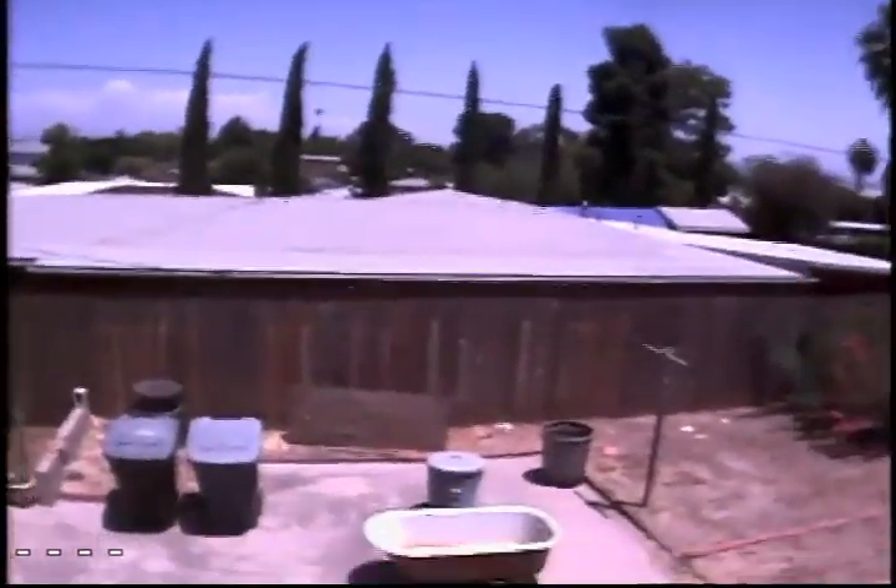We're not going to be able to get through the laundry from the roof vent. We'll pull back and see if the trap under the sink can be undone without any damage, because we're doing this for the person purchasing the home and can't make any alterations. Moving down to ground level, we're here under the utility sink for the laundry. There is the old original cast iron cleanout with an old brass plug. The trap is plastic, goes into a galvanized arm, and then into the cast iron.